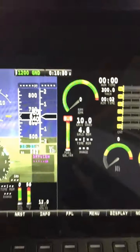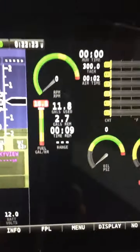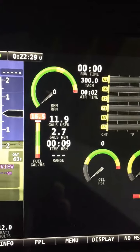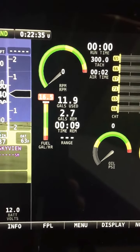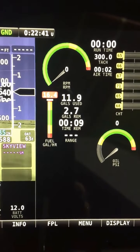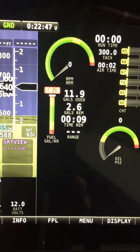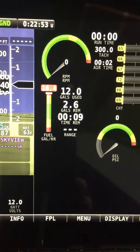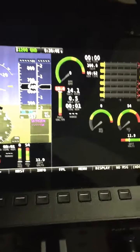Getting pretty low in the tank. There are 2.7 gallons remaining with a current flow rate of 16.5 GPH. That's less than VFR reserves. The Jabiru has a max full-power wide-open-throttle fuel flow rate of about 10 GPH, so the 150% standard is 15 GPH. I'm showing 16.5, so we're still above the requirement.